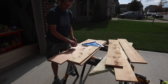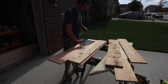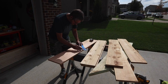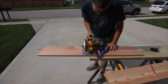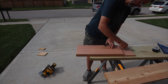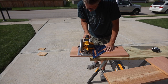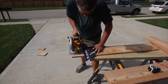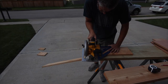Let me show you how I did it. I started off by taking some measurements of the different pieces I had, then marked out the first cuts I needed to make. For most of my cuts I'm using this large square — it helps guide my circular saw right down the line it needs to cut. For some pieces that are a little too small, I just trace the line by hand because there wasn't enough material to hold the square on there.